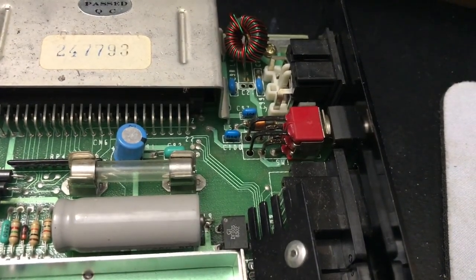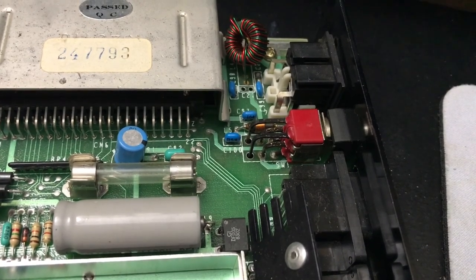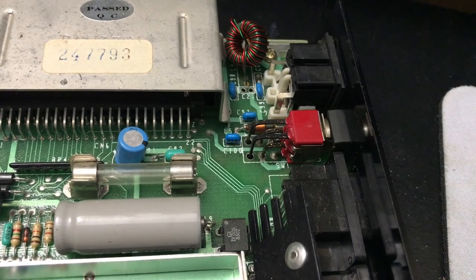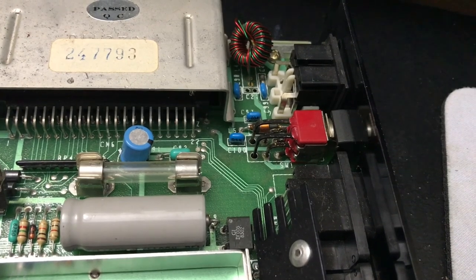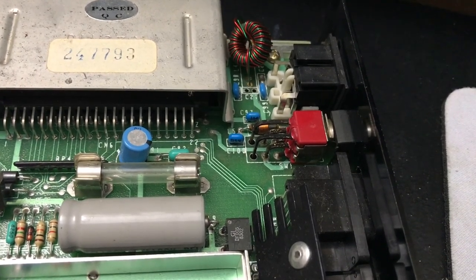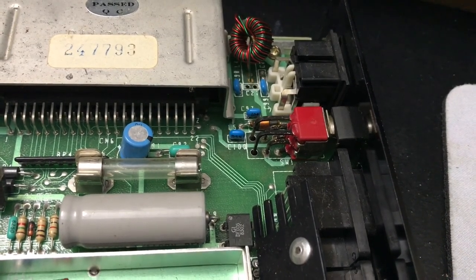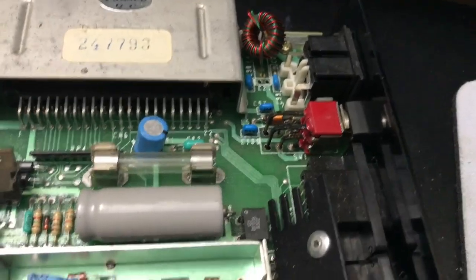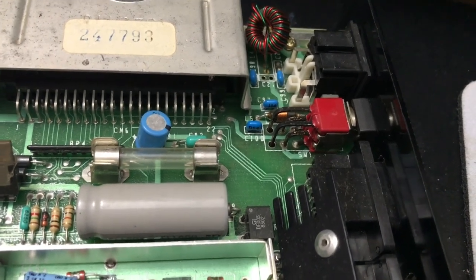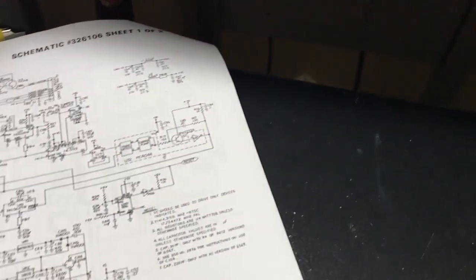There's the actual switch itself. A lot of these 1982 boards — the earliest ones have green switches, and these somewhat later ones have red switches. If you see the legs on that switch, they're heavily tarnished — basically black. I'm assuming this is because the switch legs were probably silver plated and the silver has completely tarnished to black. It's not normally a problem because the leg underneath and the solder is actually protected in the pool of solder.